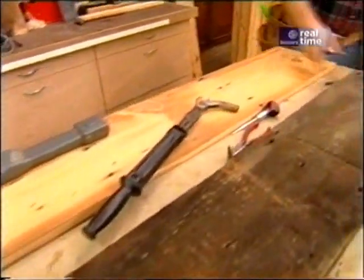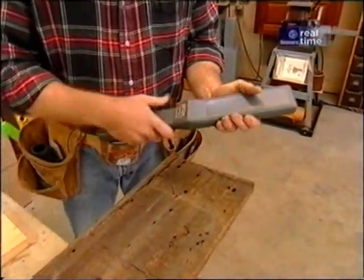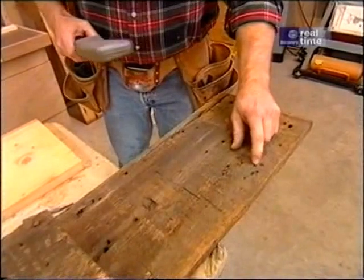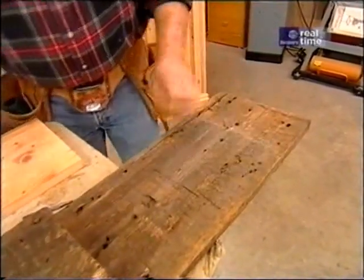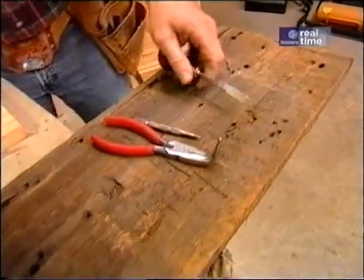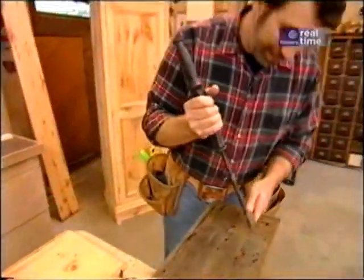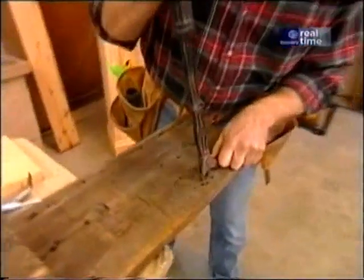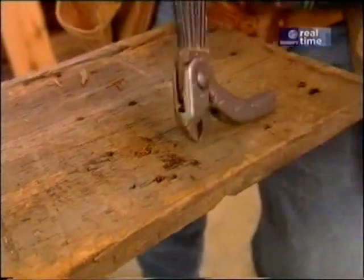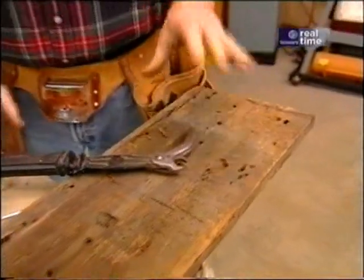There's a lot of steps and a lot of work to take them from this to this, but look at the color of the wood — it's just great. The first step is to remove the bits of iron, and you've seen me use this tool before. It's a metal detector like you would see in an airport. You turn it on and just run it over the board, and it picks up every little piece of iron. There's a nail right there. To remove them I use a lot of different tools — sometimes a nail set to drive it through, pliers, and even a nail puller. If they're at the end of a board, I often just cut it off. There's probably a half a dozen nails in this board.